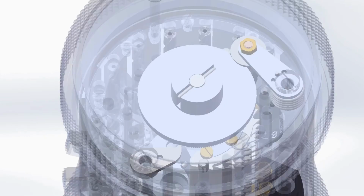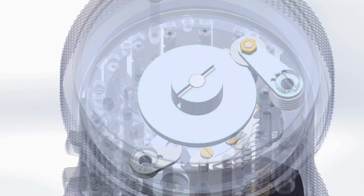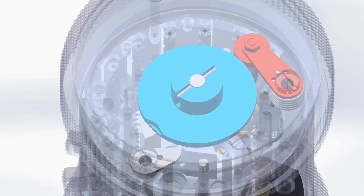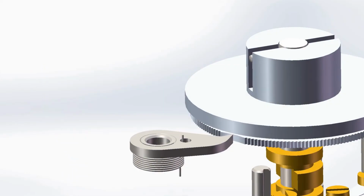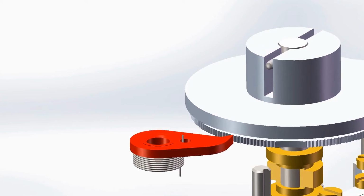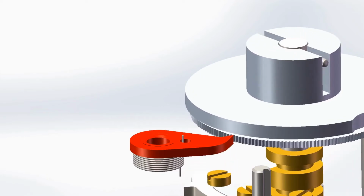Another set of features which allow for smooth operation can be found on the bottom of the CURTA. The zero positioning system guides the main shaft back into its starting position after a full rotation by means of the zero positioning disc and the spring-loaded zero positioning roller, which is pressed into the circular divot on the disc and resists its rotation in the starting position. The zero positioning disc also has a series of teeth which mate with the spring-loaded non-return ball, which prevents the shaft from rotating in a counterclockwise direction opposite the intended direction via a ratcheting mechanism.